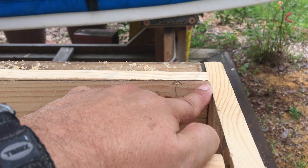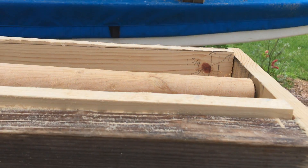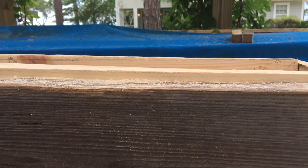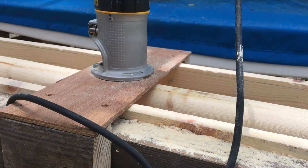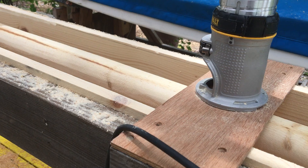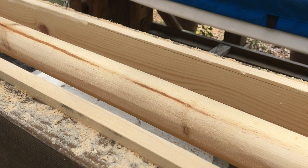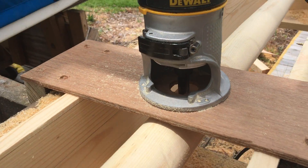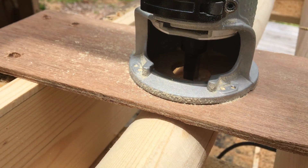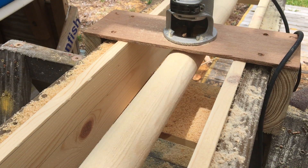So here, if we had a two-and-a-half-inch wide mast and this board was cut down to where it'd be one and three-quarters, the two of them we laid it so that as they rise up, the router will rise up on this little sled we built. At about two feet up the mast it's going to make a diameter that's two and a half inches. We set the router bit where it just barely contacts the wood and then rotate the mast to cut out a bunch of circles.